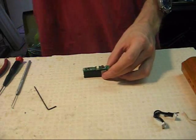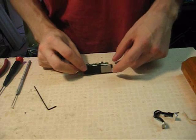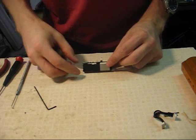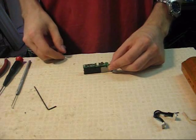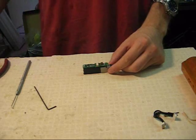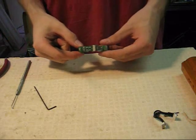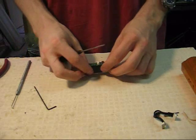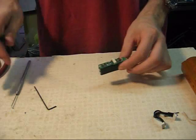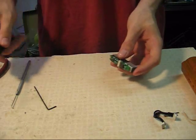The solenoid is divided into a couple of parts. This is the spool, which is the part you're going to have to re-grease. The pilot's in the middle, and this is the coil, which is the electromagnet part. The board attaches to the coil at this end, so you don't want to be rough with it — be very careful. Don't move it, don't try to pull it off; it doesn't come off. It has to be desoldered. Don't do that.